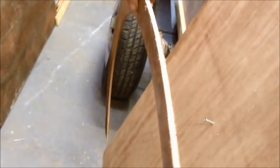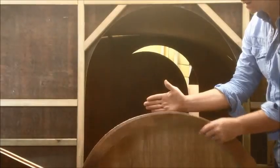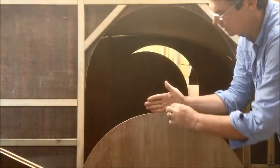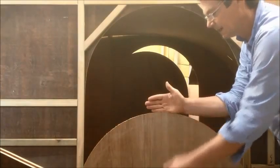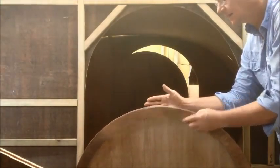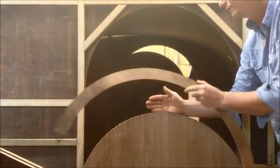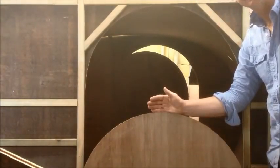Using the same router technique, I've created this edge out of quarter-inch ply, and that is going to fit on the outside of the door — just like that, you can see it there. The external skin will have a seal against it — one of these compressible plastic rubber seals — so this edge will press against there and form a watertight seal. I'm going to do two for both doors, and then for the straight edges around that's easy to do on a table saw.